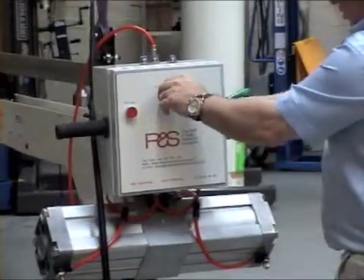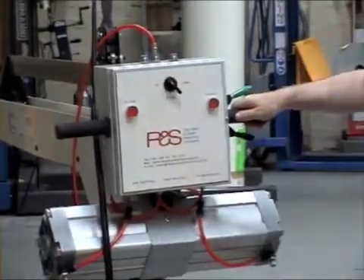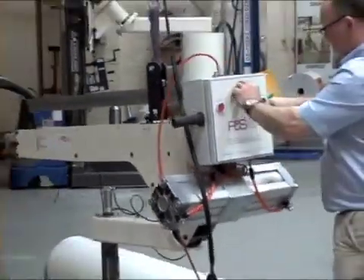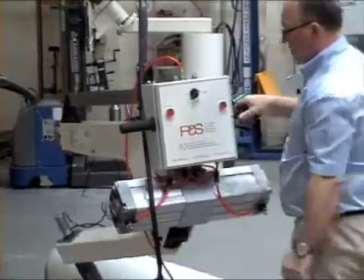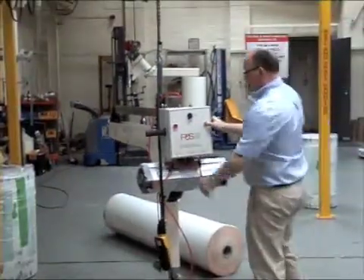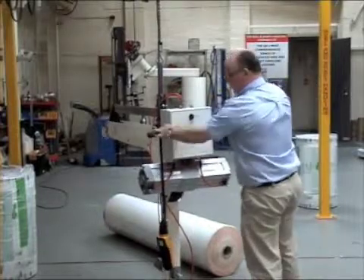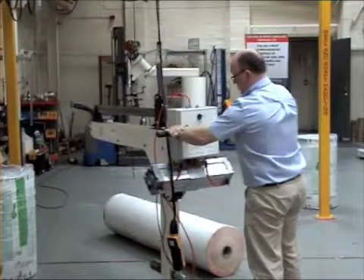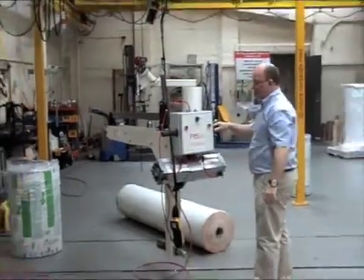We've got the up and down control of the rotating arm. We have dual release buttons which are set on a timer valve so they will only operate if pushed together within a quarter of a second of each other.